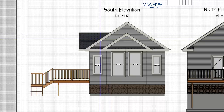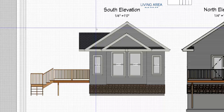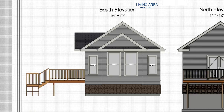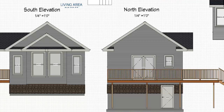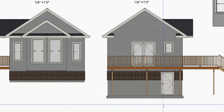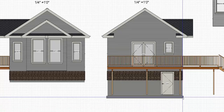However, if you did decide to go with this, they might even decide to give you the pieces that are needed to get that done. But they will engineer those trusses for a layover. And the back, pretty much the same way. You got this back door. I'm assuming that they did drop this footing down. We didn't dig or look, but you would want to make sure that this is down below frost line. Otherwise, that's going to move around a little bit on you with the frost.